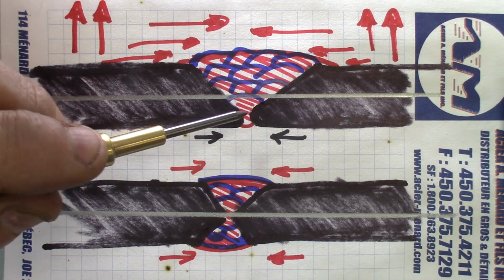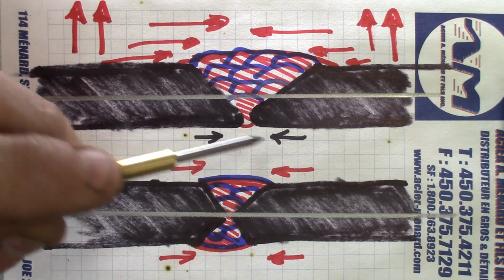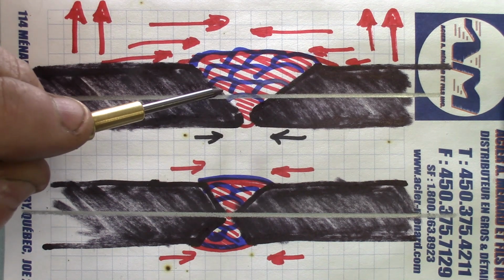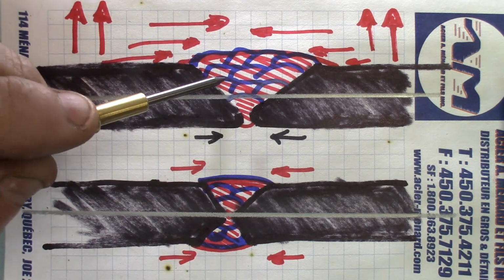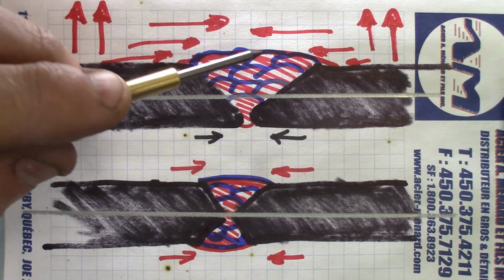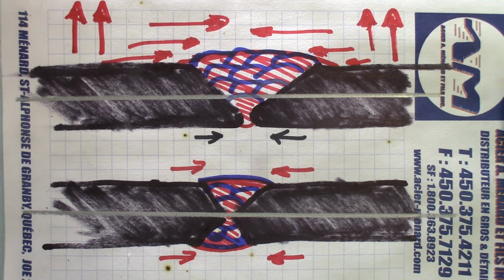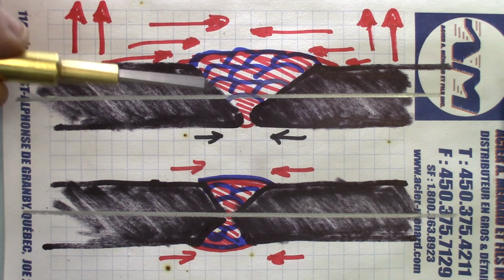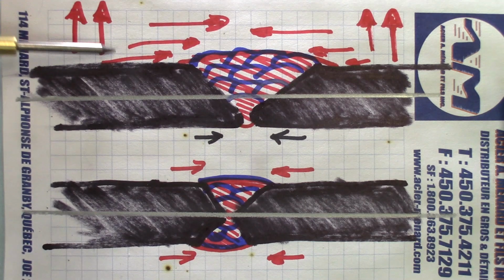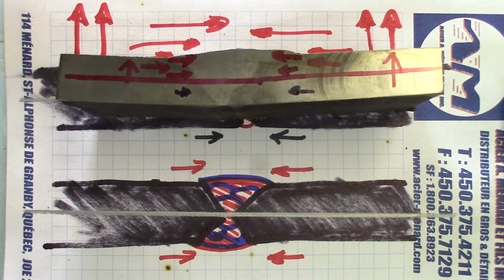So this root pass created some force under the central axis, but this force is minimal compared to the forces we added, like the linear fillets you have. Every time you add fillets, you increase the forces that bring the top of the plate together, and try to beat the forces underneath there, because the forces are very asymmetrical and much greater on the top. Eventually, the ends will pull up, exactly like what we've seen in this coupon.